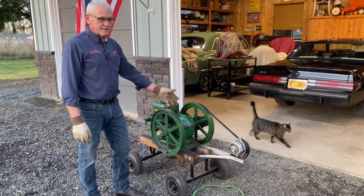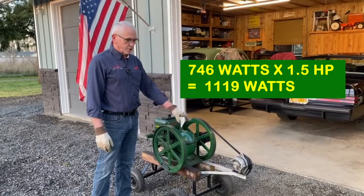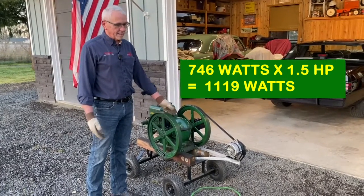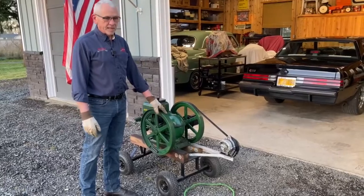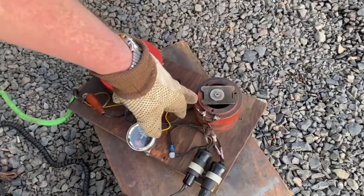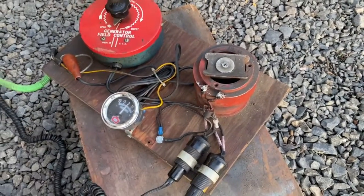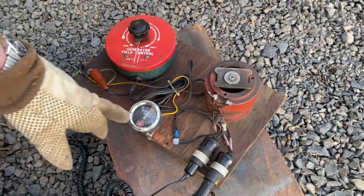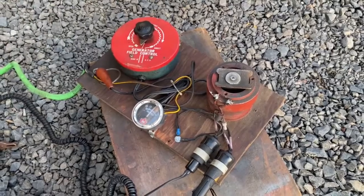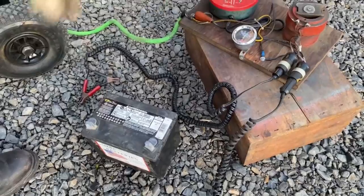The math is 746 watts has always taken one horsepower, so it should equate out to 1119 watts — and that's what it'll make. This is just a 25 SI coil and I've got it wired up; it just helps me start the engine quicker to enhance the spark. Here's our amp meter and then a rheostat to control the field to the alternator. Once we get it running we'll go ahead and hook it to this battery to charge it so we can see what's going on.